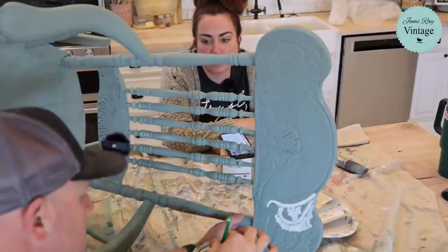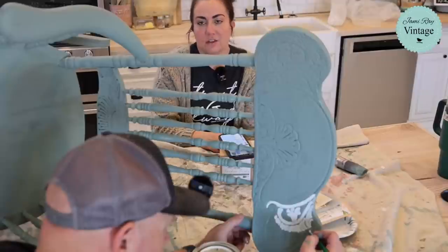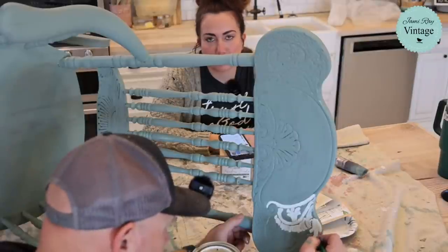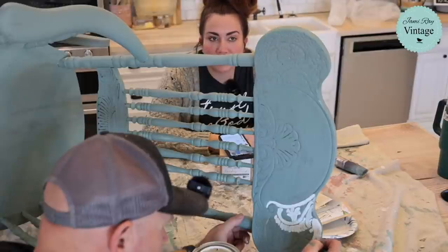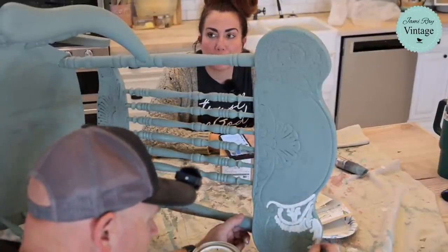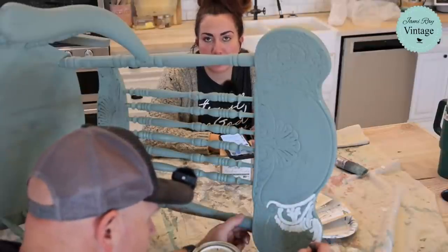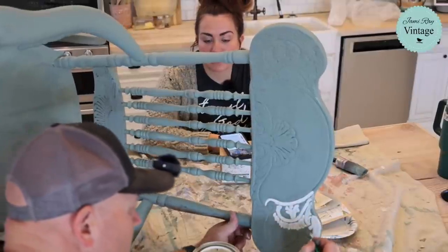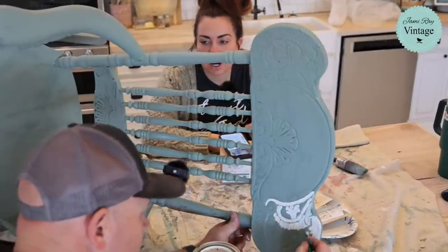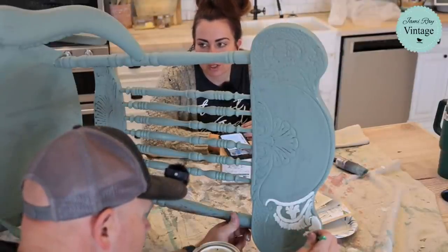Marsha asks about pieces scratching. Not all chalk paint is created equal — make sure you're using stuff that dries rock hard. We use DIY and Sweet Pickens. Make sure you clean your piece as well, and let them cure. If you give them a full 30 days it's going to be better. If something is so shiny you can see your reflection, lightly sand it or use a primer. We used Extra Bond, which is like a built-in primer that works with milk paint. Salvation Solution is also a really great primer. And let people know this isn't made for outdoors — it's an artisan-type finish. We also go for a chippy worn look, so when it ages over time it wears with the piece.